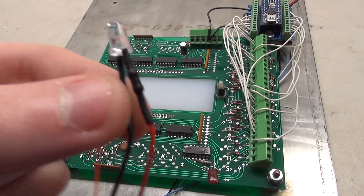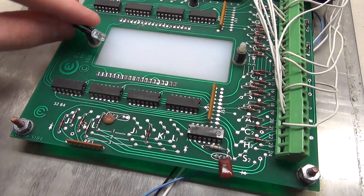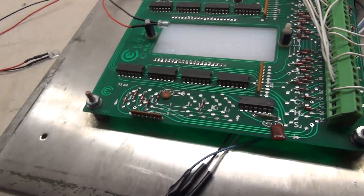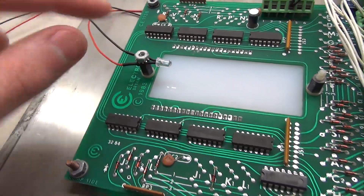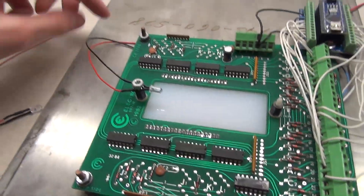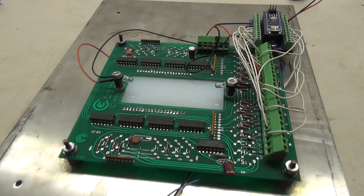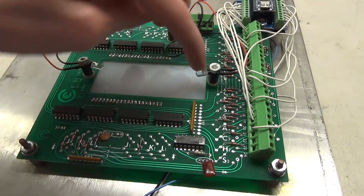For lighting this thing up, I've got these two pre-wired yellow LEDs with their little resistors already on them. What I was thinking is we could set these up inside this little bracket, wrap them around these little bolts, then put a little nut on top to hold them in place — one on either side — and adjust them how we want. Then we can just connect these wires to the five volt and ground so they turn on when the Arduino is powered on.